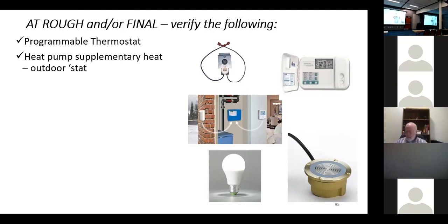They're shaped like an H. Each long leg is 1,200 feet long. And they have great big fan walls that bring in air from outside, filters that run for 1,200 feet, or it's broken into sections. Evap cooler pad, you know, the big manufactured pad that stands 14 feet high. And then they exhaust a certain amount out, they recirc some. They're not doing any refrigeration for that huge data center. Think how much they're saving. There's no ground source heat pump, there's no VRF, there's nothing that is more efficient available today.